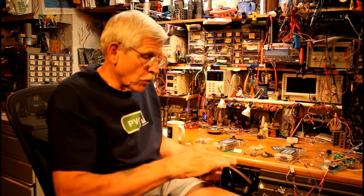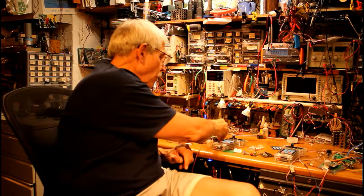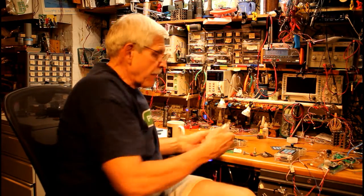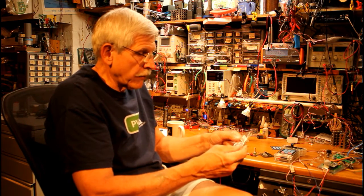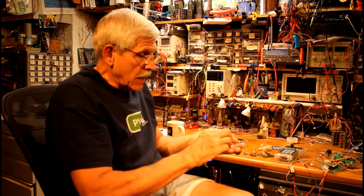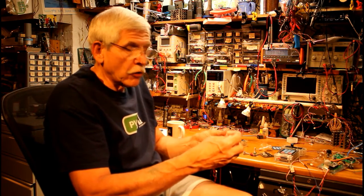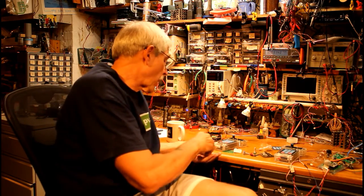The thing that's unusual is that it uses a radio link between the throttle and the controller. A very simple, very inexpensive radio link. I've got a couple of them here. About $5 for each end of this, so you're going to need to spend about $10 on the wireless interface. And other than soldering on a small antenna and adding a few pins for a header, there's not much that has to be done with this. A little bit of configuration that I'll show you, and it does a beautiful job of connecting the two wirelessly.